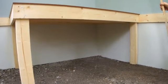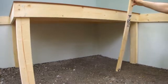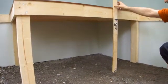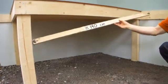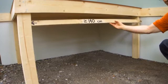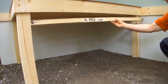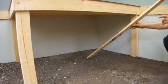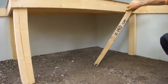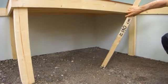Underneath the toilet room you should have a space for the composting tank of at least 65 cm high and preferably 140 cm wide. Make a channel into the bearing ground surface starting from the center of the future composting tank for the liquid exhaust pipe.